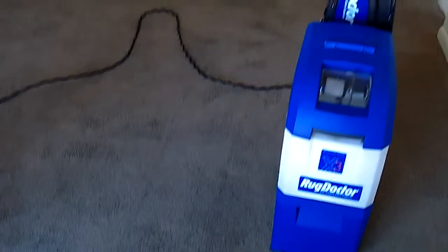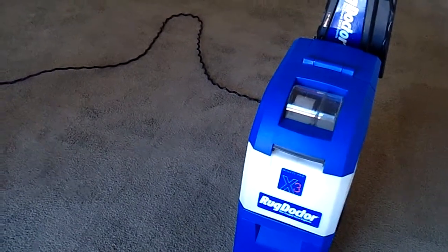Yeah, and these carpets, we didn't scrub anything with the Orc because it just wasn't that dirty. When it is clean, we normally just run the Rug Doctor over them and clean them that way, because you're only doing one pass, so you're not getting the carpets overly wet. And this carpet's about 4 years old, so when we rake it, there's gonna be some spots that look different on the video. That's because where people put their feet when they're sitting on the couch, they rub the carpet there and it gets abraded. You can't ever have the carpet looking perfectly even again because you can't fix worn out spots. And that's basically all that's gonna be left in this carpet. It's clean, but it's an older carpet.